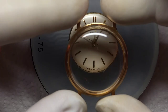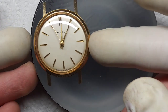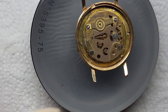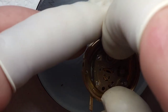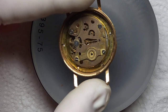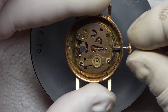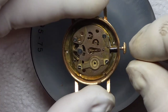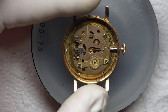In there was a second hand - I knew it was going to happen. Now dropping the old casing back on. The reason I didn't show you putting that second hand on is because it was an absolute pain in the hoop, as the Scottish would say. That second wheel as it goes through is only retained by a tiny little spring, so you've got to try and hold the second hand in and hold that pivot in, then push the second hand on from the other side - otherwise it just pushes straight back out. Frankly, that was a nightmare and it didn't make for interesting viewing.